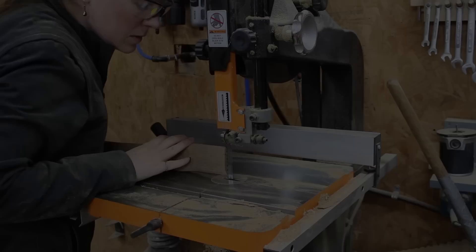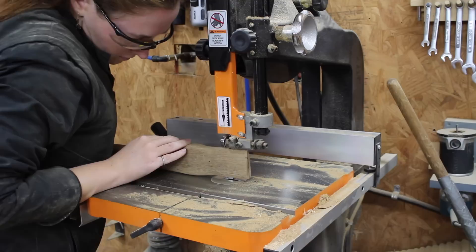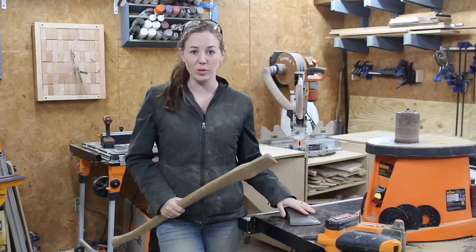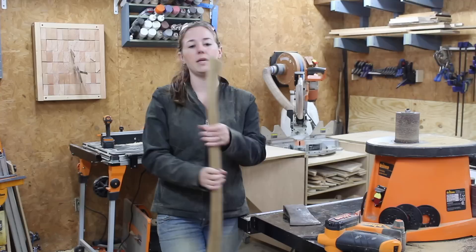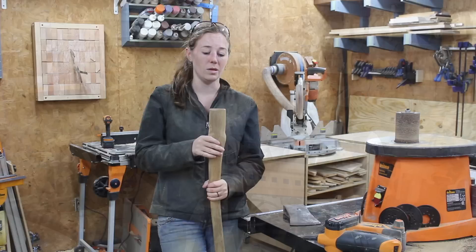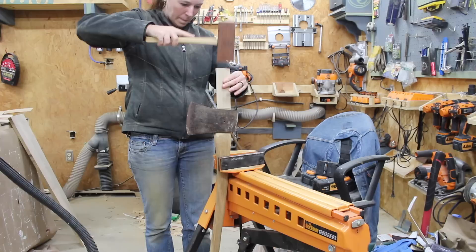The very top tapered portion of the axe is called the eye. I used power tools to cut it in. Once I got the eye down to where the axe head would fit roughly about an inch onto it, I then cut a slit right down the center with my bandsaw. Since I couldn't use the hanging method, I clamped the handle in my super jaws and tapped on the head. Once it was seated completely on the shoulders, I cut a wedge from poplar — a much softer material — then glued and hammered it into place.